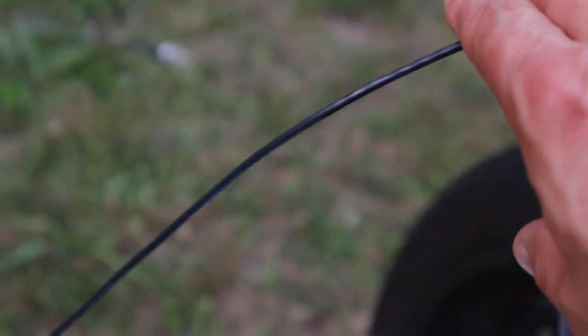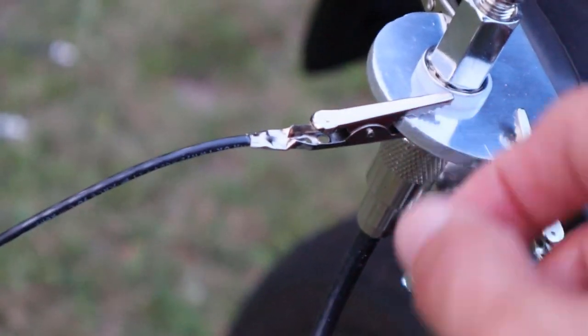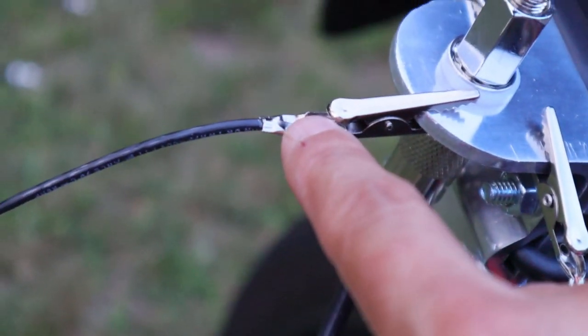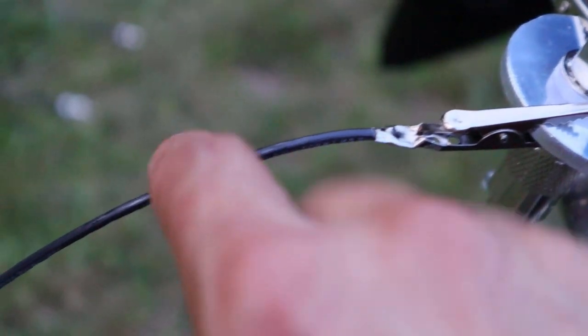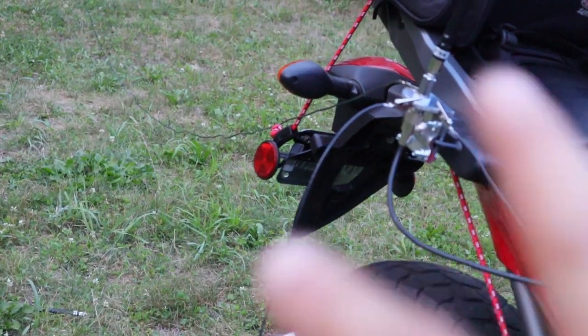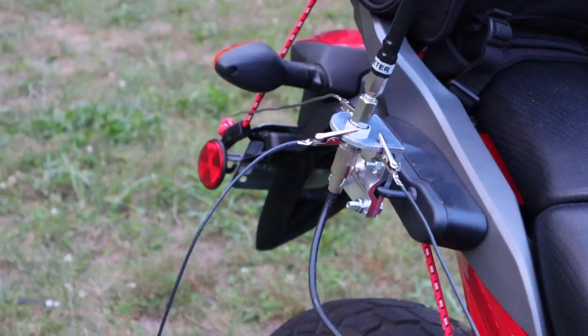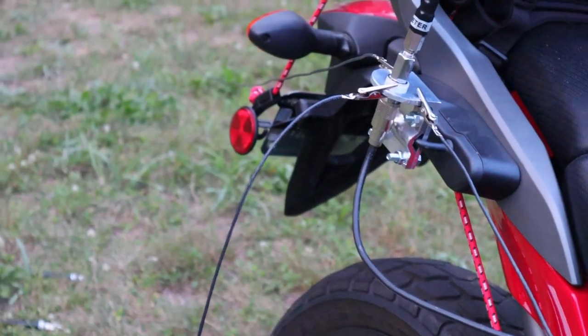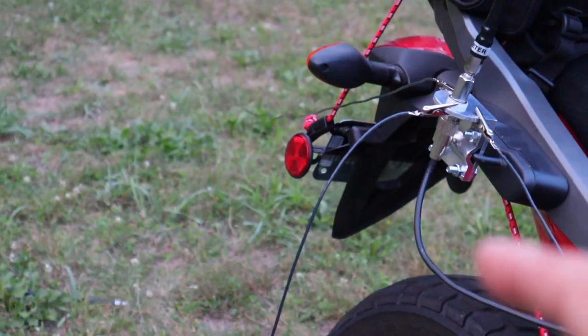Let me go freehand with the camera so you can see the radials. Right now I've got alligator clips crimped on, but I will solder these onto the end of some 14-gauge Home Depot THHN wire. I've got them cut to about 16 feet just to minimize the footprint — you can see it goes off to about where that brick is. In the future I may experiment with shorter, longer, or band-specific radial lengths, but 16 feet seems to work okay for 20 and 40 meters.